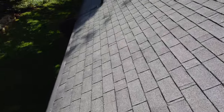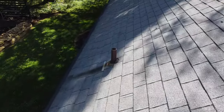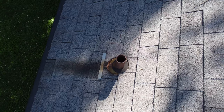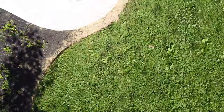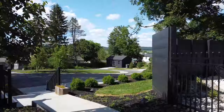These observations will be in my report along with my drone video and inspection images. This roof is older and needs to be replaced due to its age, granule loss, and blistering. I'll definitely look inside for signs of a prior or active roof leak using my observations and moisture meter. I'll also recommend further evaluation by a professional roofer. Based upon my inspection of these two different types of roof covering materials, my client now has all the information they need to make smart decisions.